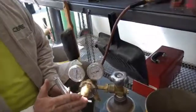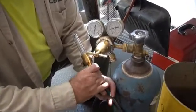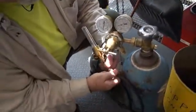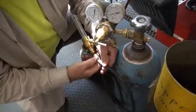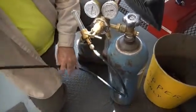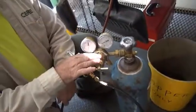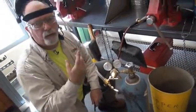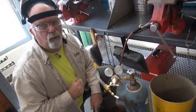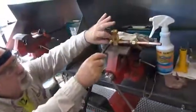We know that the valve is back-seated. Take one end of the hose and secure it to the ball valve. We don't want 200 psi running through our valve system and our air conditioning system, because you'll never be able to seal that fitting at that pressure.